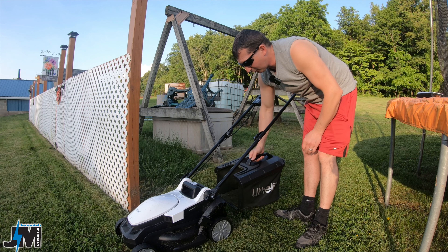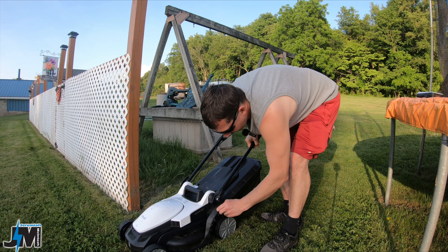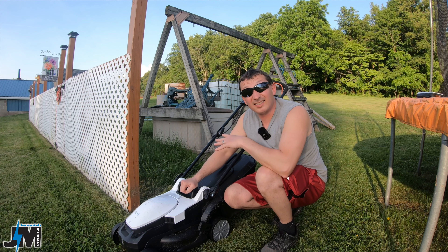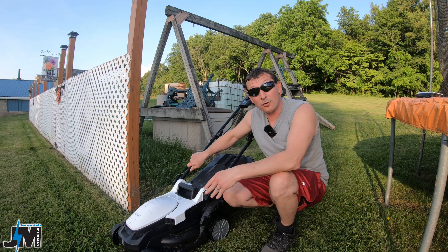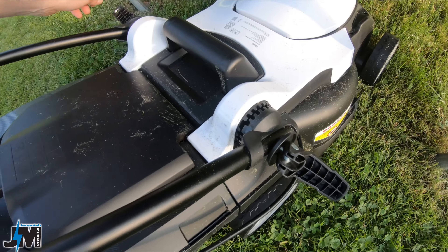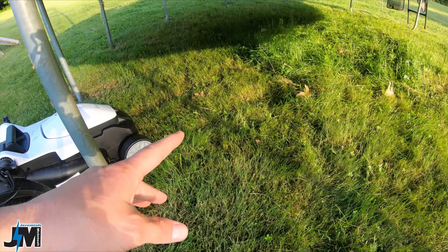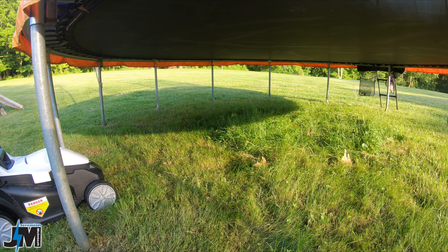It comes with a small little bagger. One thing I noticed — the bagger does not fit out through the handle, so you have to take it down underneath. You've got five levels of adjustability on your height. I did notice that I cut mostly in four today, and this deck is almost all the way up. When I start this thing up, listen to it — it has an automatic speed adjustment. It'll start out in slow speed, and then when it hits higher grass, you'll hear the speed ramp up. You can hear it ramping up if the grass is taller, or ramping down if it's shorter.